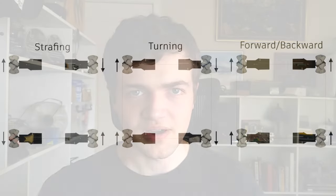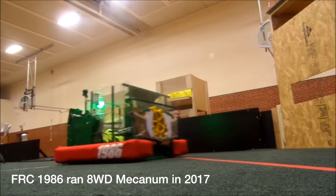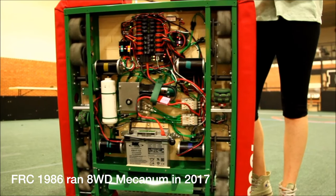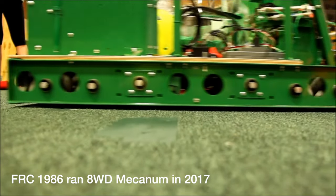This drive uses unique omni-wheels with rollers set at 45 degrees. This makes them very similar to a 4-wheel X-Drive, but with the added benefit of greater forward and backward speed like a tank drive, and a similar frame construction. Such top speed differential can be advantageous or not, depending on how critical matching the motor speed to the ground speed is. Selecting for a combat robot specifically, all of these options have existing examples that I'm aware of, bar H-drive. No matter which option is chosen, some common deficiencies are pretty much unavoidable.